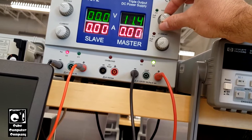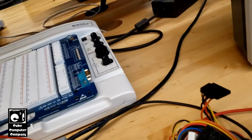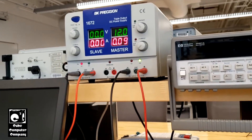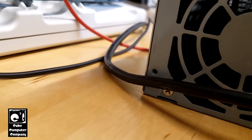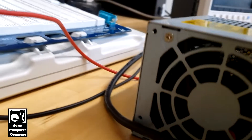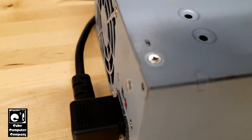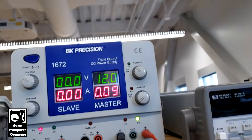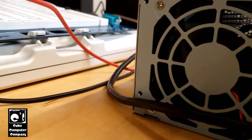I'm going to try 12 volts on the 12-volt rail. The fan might actually spin while I do this. You can see it's pulling about 10 milliamps. The fan is running — it's actually running at its low speed, it does have speed control. So back-feeding the 12-volt rail in this unit is actually powering up the fan circuit, which includes the temperature control. The whole thing is just pulling about 10 milliamps — that's the dummy load resistor as well as the fan running.